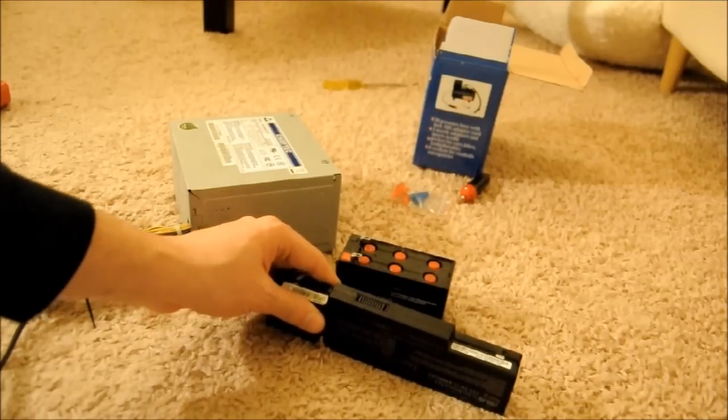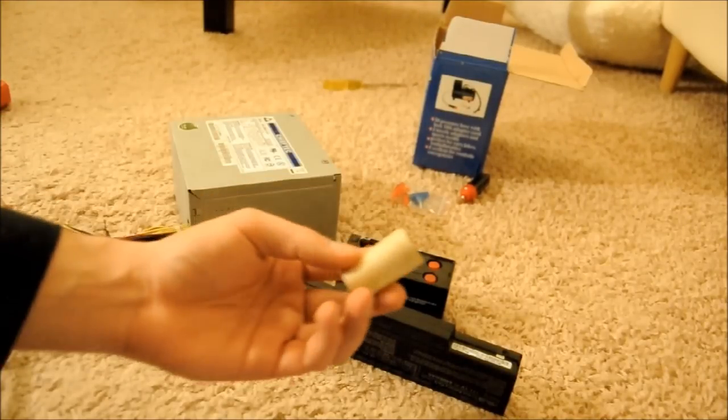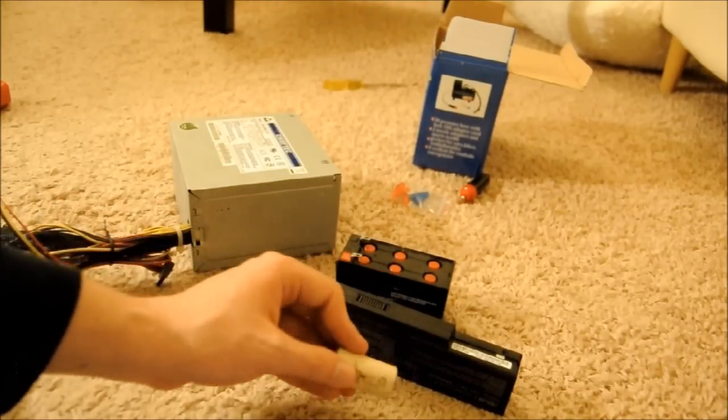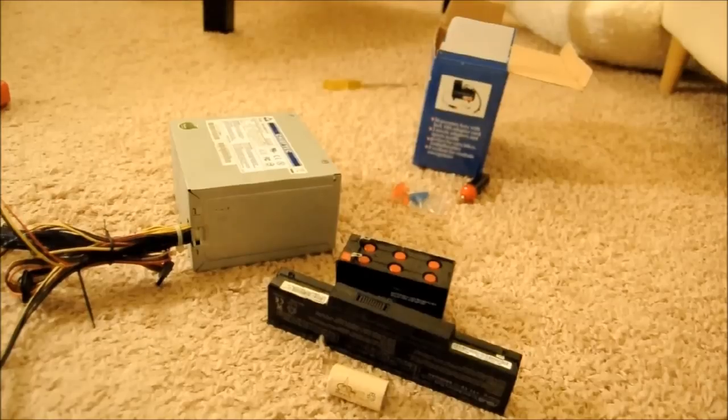You can also use an 11.1 volt laptop battery that is at least 2 amps, but if it keeps shutting off, it means that starting on working current flips the battery's internal breaker. 10 to 13 1.2-volt rechargeable cells can also be used in series.